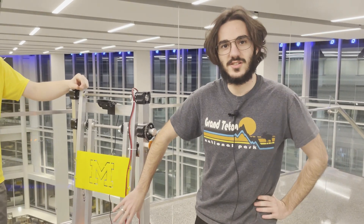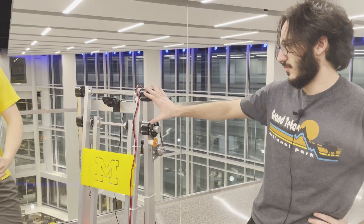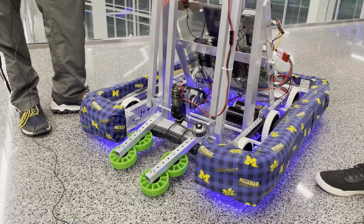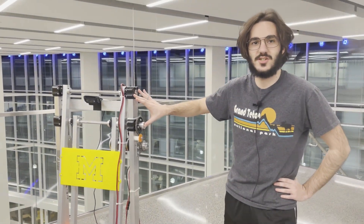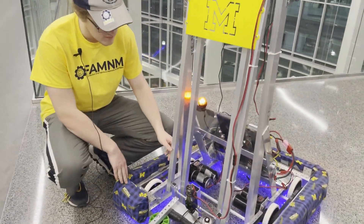So I'm here to talk about the four-bar linkage — this is mostly what I worked on. As you can see, our robot heavily relies on this arm to move our game pieces once they are in what we call our hand. This four-bar linkage — some of the basic measurements — is around six inches apart over here, and that is mirrored down there at the bottom, and that is how we keep our four-bar plane parallel.